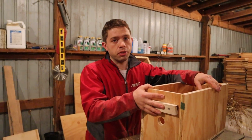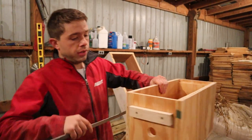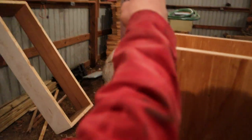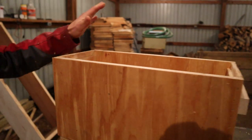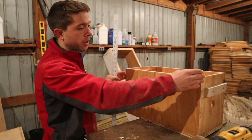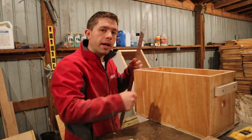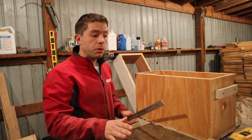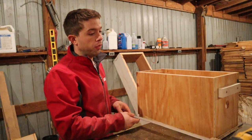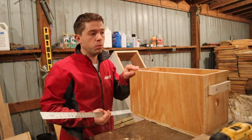All right, let's get to the measurements. On this side, it's real basic: we have 20 inches by ten and a half inches. So we have two pieces that are 20 inches by ten and a half — that's not hard to do. Just make sure your boxes are square. Use a square and make sure everything is square, or your boxes will rock when stacked and won't fit quite right. Most people forget to square up their equipment — and don't assume that because you purchased it from a company that it's already squared.